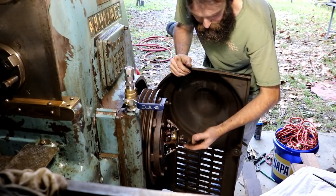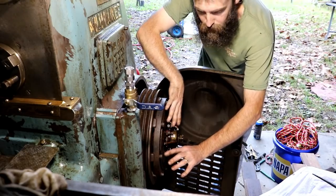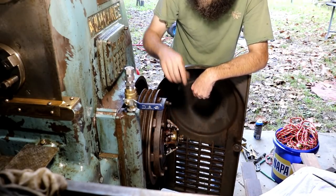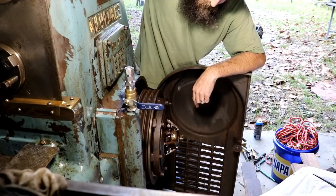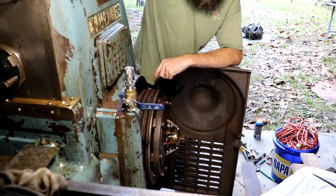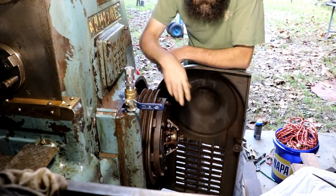All right, now here's, I just call it a bell because it kind of looks like a little bell, and it's got sloped edges, and when this bell pushes out, it squeezes on these fingers and sandwiches the clutch plates together, and that's what transmits the power from the motor inside to the gears. Now, I noticed when I moved the clutch lever that this thing wasn't moving. But it is now, watch. So I'll engage it. You can see that it pushed out and squeezed the clutch plates, but when I disengage it, it stays engaged. I took a rubber hammer and I tap it, and it releases.